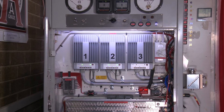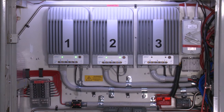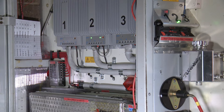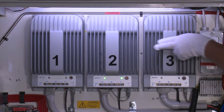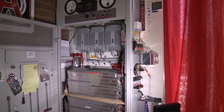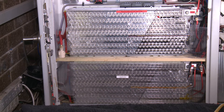My project was built into a heavy steel professional cabinet donated by a good friend of mine, Tony. I built the project around three Tesla battery modules. Each battery can be switched in or out at any time. Here you see my three 40-amp solar tracer chargers, one for each battery. My project did not require any further battery monitoring as these chargers have a great low voltage safety cutout inbuilt.